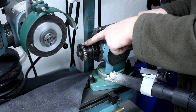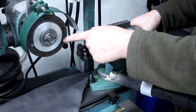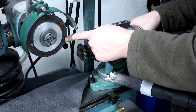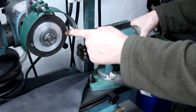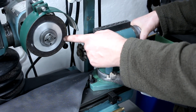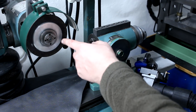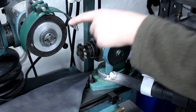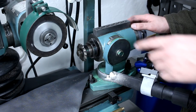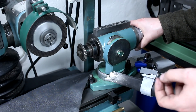Since I have to remove really a lot of material - almost one millimeter - I'm using a cutoff wheel, because these cut very cool and very fast. This is a 3M Cubitron 2 cutoff disc for the handheld angle grinder, and I found these to work exceptionally well on stationary machines like a surface grinder and tool cutter grinder. They are cheap and they hold up forever.